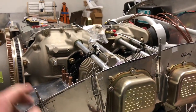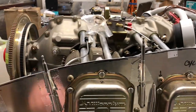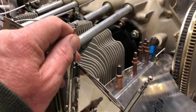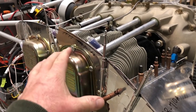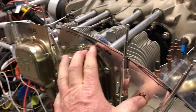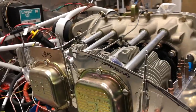I've never done this before, so this is the first time. I can see why people say it's frustrating getting down to that first point where you can do fine-tuning. People do a lot of fine-tuning, chopping off a little bit at a time because they're afraid they're going to take off too much. These pieces don't cost that much, but I figured if there's a way to save a little bit of time, put this all together, and have a way of using this on a four-cylinder Lycoming — or in this case on a parallel valve — and then use it as a tool to transfer those lines.